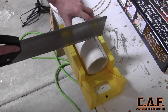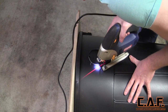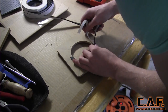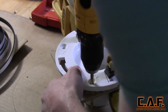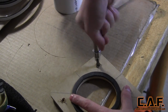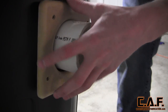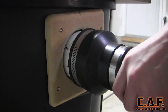Next I cut a 4-inch length of my 4-inch PVC pipe. Since this pipe will need to go through the side of the container, I trace the outline of it and then cut out the outline using a jigsaw. I then use PVC glue to assemble the PVC pipe and PVC flange together. To ensure an absolutely airtight seal, I apply the speaker gasketing material to both sides of my new flange. I clamp the two flanges together to drill my ¼-inch guide holes for the machine bolts, then thread in ¼-20 threaded inserts into the wooden part of the flange. After drilling the four mounting holes, I inserted the PVC part of the flange from the inside of the OSCAR and attached it to the wooden flange. I then attached a rubber adapter which steps the size down from 4 inches to 2 inches, which I can use with my dust collection system.